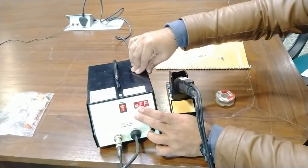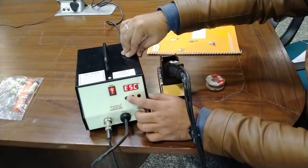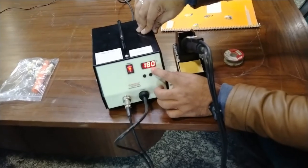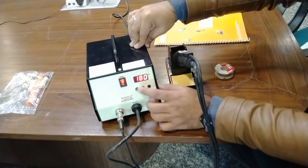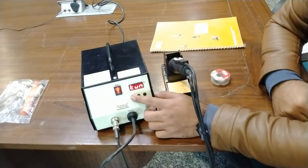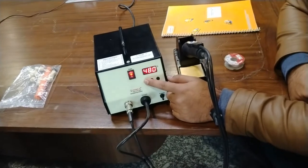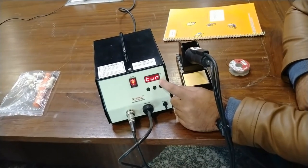To access configurations, press and hold the power on/off button for two or three seconds. After that you will go to the password screen and different parameters will be shown on the screen. This is the low set point — you can set the low point anywhere you want; right now it is set at 180 degrees. The next parameter is the high set point, which can be set up to 480 degrees or any other value as desired.